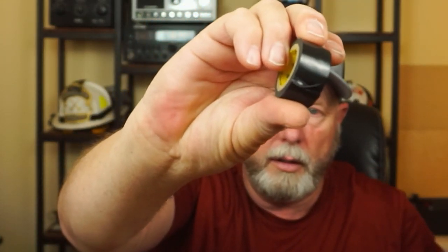You might also want some decent scissors — they're okay, not the greatest, but they help for cutting stuff sometimes. Now this is a Craftsman tool — I cut coax with it because it's hard to cut coax without bending it. This thing goes right through like butter — it's basically a razor blade inside. It works really well for cutting a lot of stuff, and like I said, coax especially. Also get some tape — this is 3M Scotch electrical tape. A ham who's been doing this forever told me this is the stuff. It's super pliable. The one bad thing is when you wrap it tight and break it off, you can't find where you broke it. I'll bend the end over so I can find it — it sticks so nice but gets a little gummy if it gets hot.